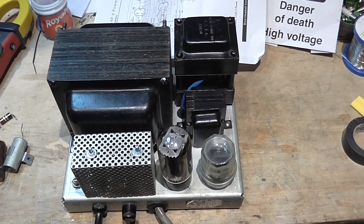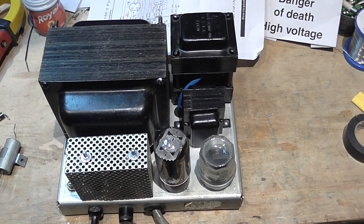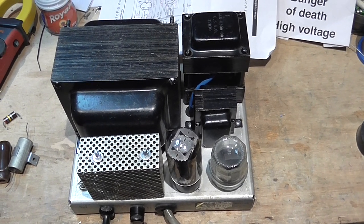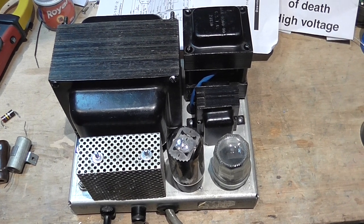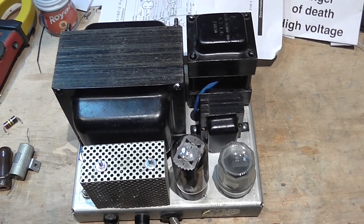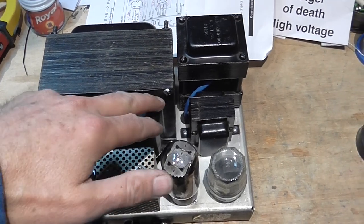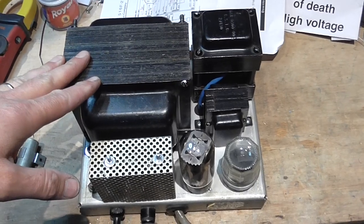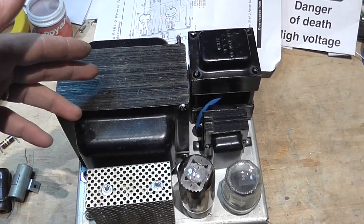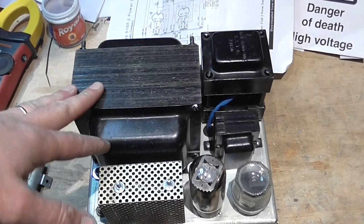Apparently I have finished repairing the power supply. It was a long repair — mostly everything in the power supply had failed in some way or another. Some parts may have failed some time ago and caused other components to fail. The person who did the rewinding told me it wasn't like a sudden short that damaged one winding, but the whole transformer had been suffering from heat for a long time.